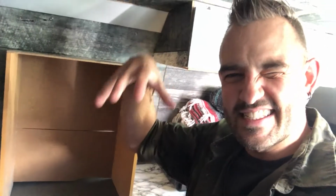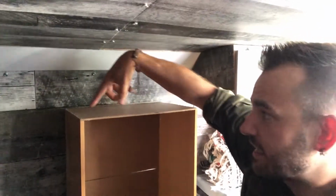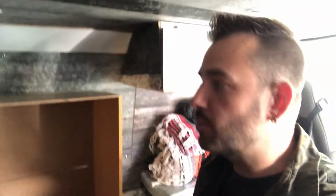And like I mentioned, I did use the staples, but of course, good old trademark, there's construction adhesive in there as well. I didn't put construction adhesive on the top because again, it's down. If that becomes an issue, that should be a super easy fix. There's plenty of room up here to get that caulking gun with the construction adhesive and redo that if I need to, but I think we should be okay.